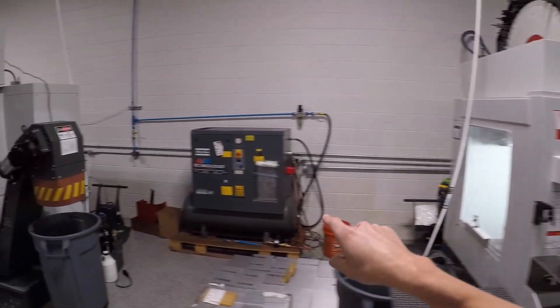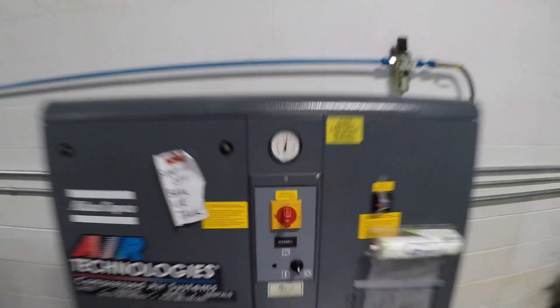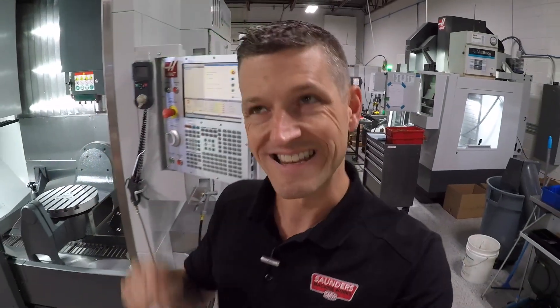We're right at the point of needing a second or bigger air compressor. We love this Atlas Copco — it's a 7.5 horsepower, and it's honestly been bulletproof for about six years with 3,800 hours on it. But a friend with a similar compressor had his just kind of blow up on him, and if we don't have an air compressor we're down. The value is going to be having a second redundant compressor. I think we're going to buy one called a FIAC (F-I-A-C). It has a digital control, so it will allow us to adjust the start-stop pressure and set up a lead-lag system. That compressor comes on at 100 and turns off at 140, while our new one will turn on at 105 and off at 140 — so normally the new one will do most of the work, but if we use a bunch of air the second one will kick in. Every so often we'll switch the PSI ranges so the old one also spends time as the primary.